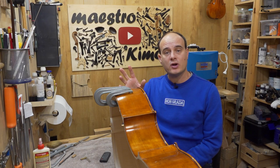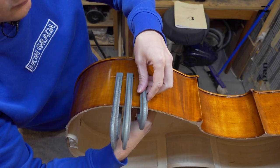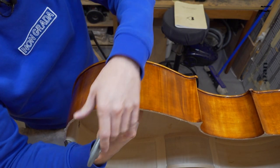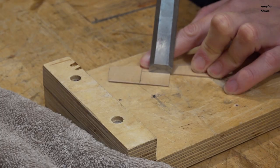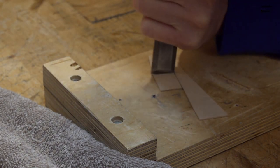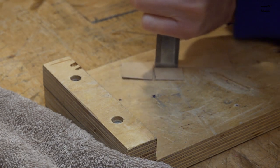Now I have to wait a couple of hours until the glue is dry. Now that the glue is dry I can remove the clamps. Before I put the top back in place, I want to add another piece of reinforcement here over the small piece that was separate. For these repairs I also use airplane plywood — the kind used to make model airplanes. It is very strong, very thin, and it bends very well, so it's easy to fit on the curved surface.